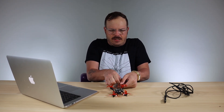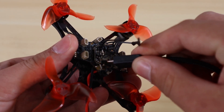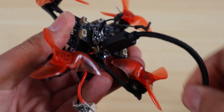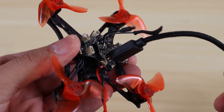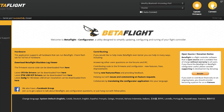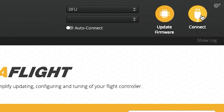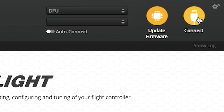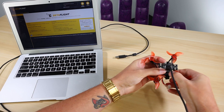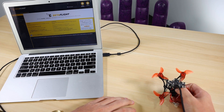Unplug the drone, identify where your boot button is. What I like to do is plug the USB into the board first since that's the hardest part, and then once it's plugged into the board, hold down the boot button and plug the other end into the computer. You should see in Betaflight that 'DFU' pops up in the top drop-down menu in the top right — that means you're in DFU mode and you're able to flash. Holding the boot button and plugging it in — and just like that, it went to DFU mode.